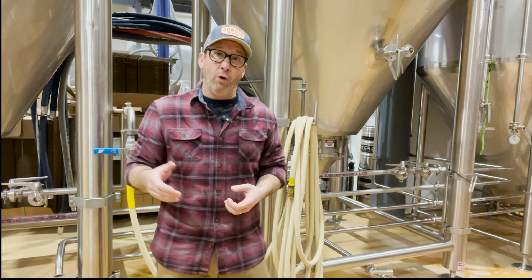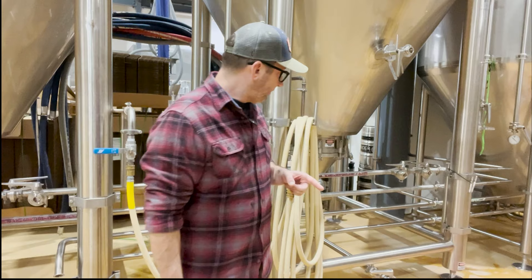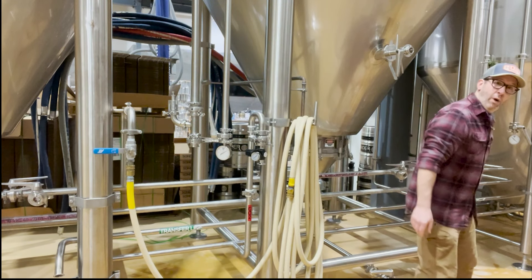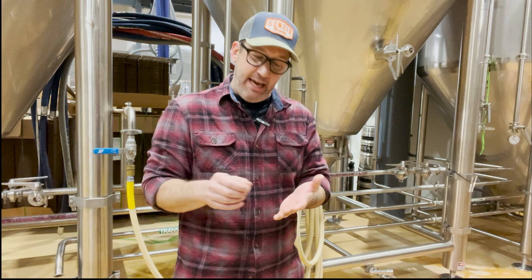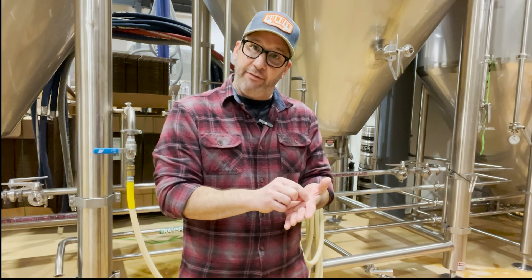Something that's very cool. What we do is, while we're doing this, we do keep an eye on the temperature of the sterilization tank water source, and we also use little welder crayons. Both on the in and the out of the item that we're sanitizing, we're going to make sure that that crayon is melting on that surface.